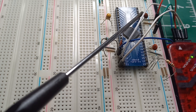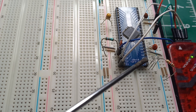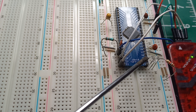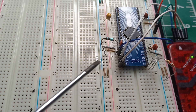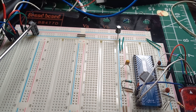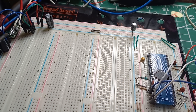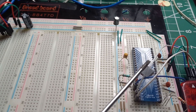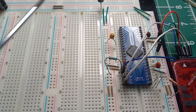Put decoupling caps on all the power pins. You have a programmer connected here. This is the LED you'll be using to test and ensure that the circuit is set up properly. You always want to reserve one pin for that in case your program doesn't work. You also want to have these nice capacitors on the input power supply — a 1000 microfarad, another 1000 microfarad, and a 100 microfarad.